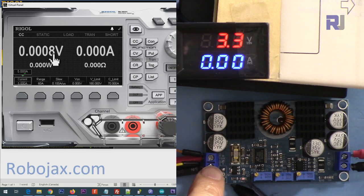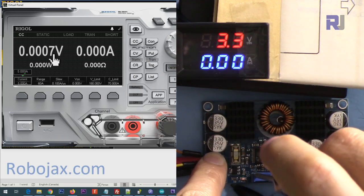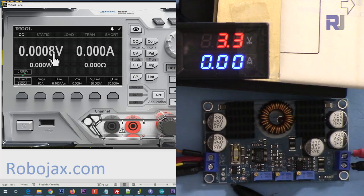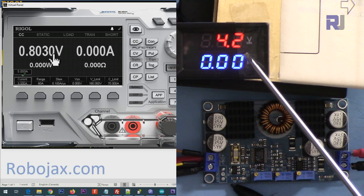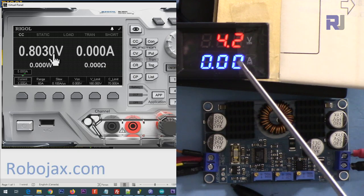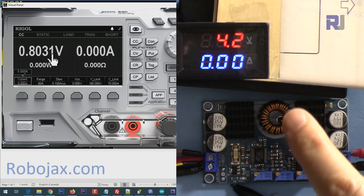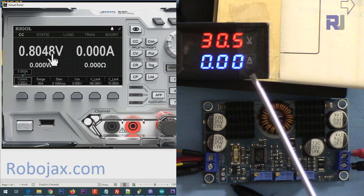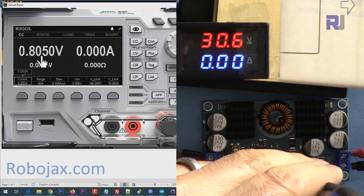The fault LED is now on. I can see it here. It has no effect while the voltage is gone, so let me increase the input. We need to have 4.2 volts in order to get 0.8 volts output. Now I'm increasing it going to 30 volts — and as you can see it is still holding. Let me now increase the output voltage.